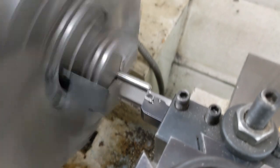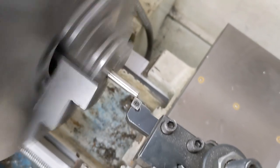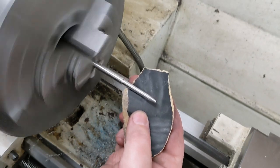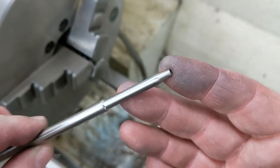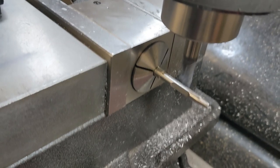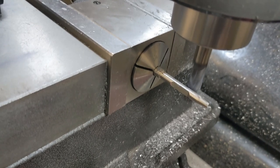To the lathe! I didn't make drawings or anything, since what I had in mind was pretty simple. I drilled and tapped one end, then cut a taper on that end so it could be pulled smoothly through the stitches. This is one-quarter inch stainless rod, about the same diameter as a number 9 US needle, or 6mm. I figured that was a bit excessive, so I turned the shaft down to about three-sixteenths of an inch, then spent some time cleaning it up with sandpaper so it'd be nice and smooth. Putting the rod in a collet block — one of my absolutely favorite shop tools — I flattened opposing sides on the mill, thinking a classic eye-of-a-needle look would be nice. I did this with the side of a large end mill so it would leave a gentle radius on the lower edge instead of a sharp cut for yarn to snag on.